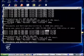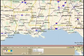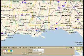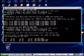Moving on, the second tool is called traceroute, and it's spelled T-R-A-C-E-R-T. So type that in, followed by the name of what you want to trace the route to, or a TCP/IP address. Press enter. Just like placing your finger on a road map and moving it along the route to your destination, traceroute travels along the network wires, recording its path along the way and printing it back on your screen.